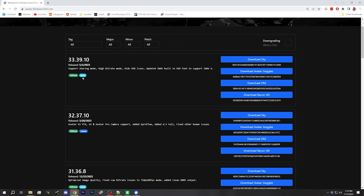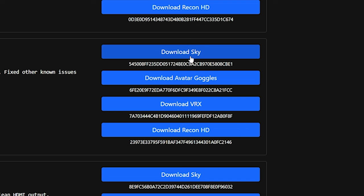What I'm going to recommend we do is download the latest release version. So this 33.39.10 is a beta. I'm going to suggest that we skip that one, and we're going to download 32.37.10, or whatever is the latest official release at the time that you are watching this. And then we're going to need to download two things. One is the Sky firmware, which is for the video transmitter, which is up in the sky, right? That makes sense. That's what they call it.